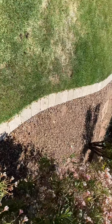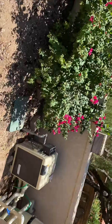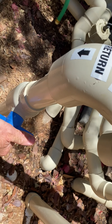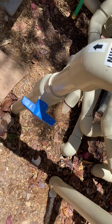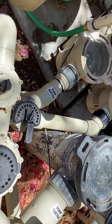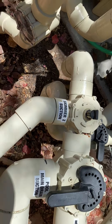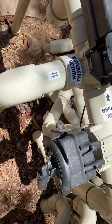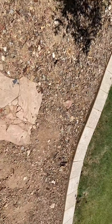When adding DE to the pool, there is a very specific way that needs to happen. This line right here must be shut off 100%. If it's open at all, you will get DE back in your pool. Then this line here, you can just open this up just like that. I've opened up this skimmer line here, so the suction is open on the skimmer and the return is closed on the skimmer. So now, if I want to add DE...